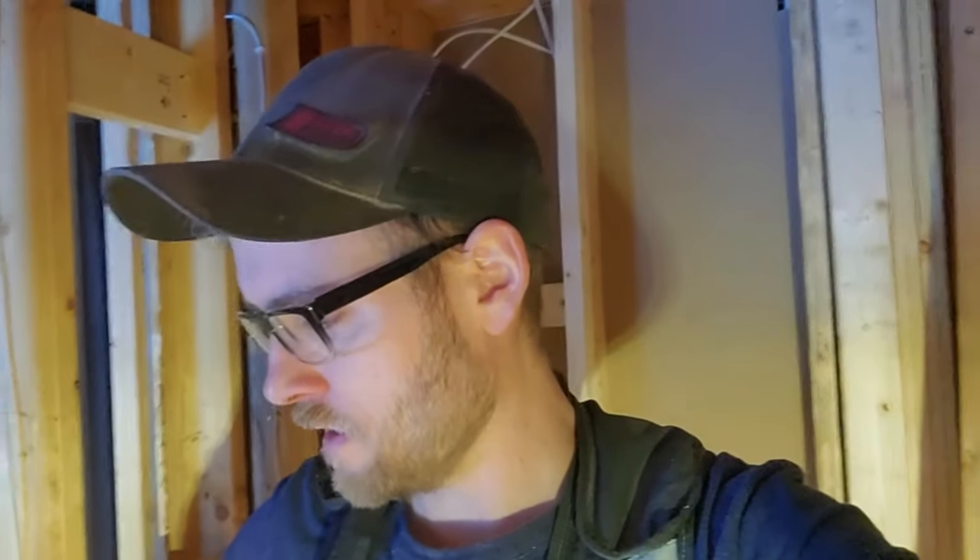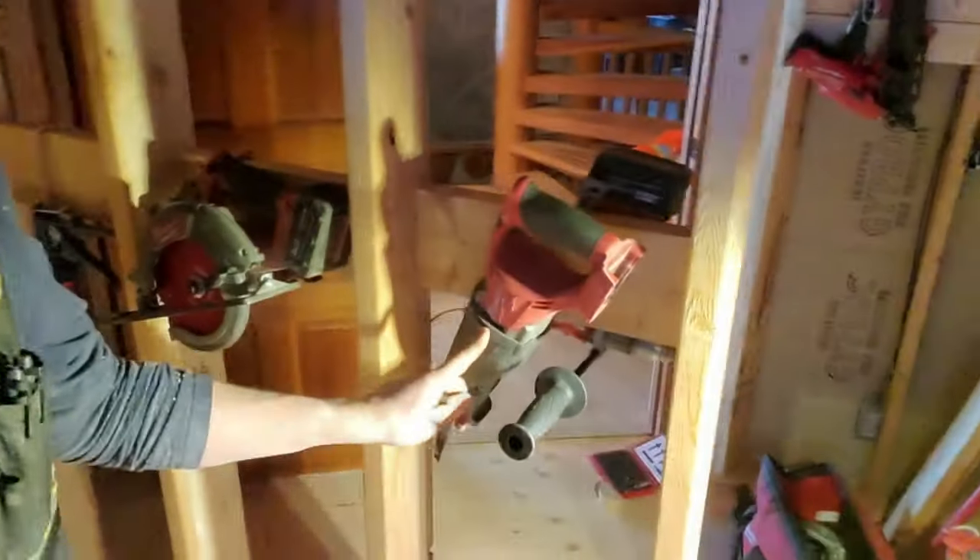Let's think about cost. We've all been down the aisle at Home Depot and looked at a box of structural screws — there's 425 screws in it and it costs over $100. The amount of nails to frame this bathroom if you just used framing nails probably wouldn't cost 10 or 15 bucks. So you might think you're out 75 or 80 bucks — wrong. When the plumber and the electrician are here, these fellows are charging over $100 an hour. So the little bit of cost tied up in structural screws does not even remotely hold a candle to me having to get out this horrifying tool — the Sawzall. That's what you'd have to do if this is all nailed together.